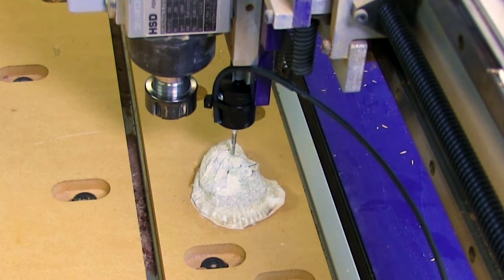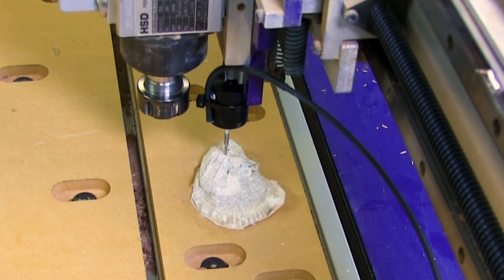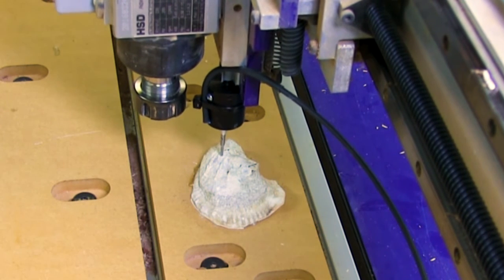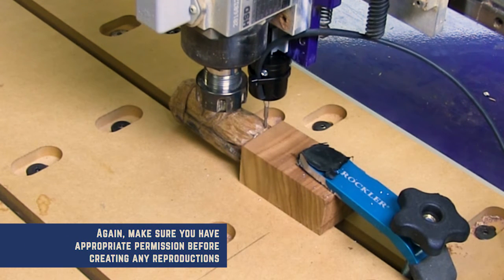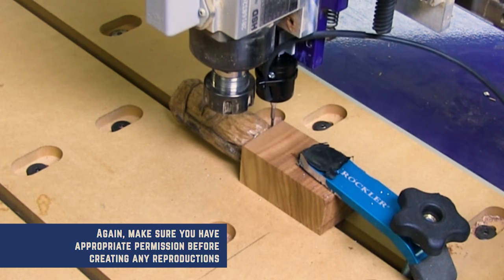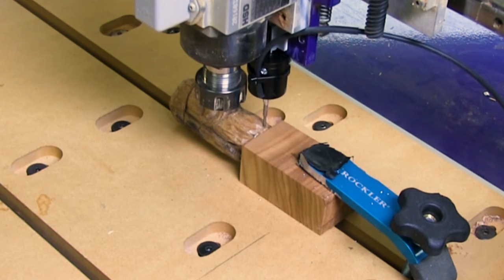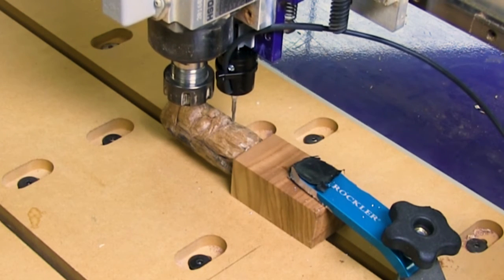The Z is automatically adjusting to that thickness as the probe works its way across, left to right. I'm not doing anything — I'm just standing back and watching all this happen automatically. Once the work with the probe is complete, I'll be able to bring that file into my design software and set this up as a carving that I can do using my CNC, duplicating the shape of the shell. I really love this application of the probe. What it's working on here is a carving in butternut that was done by a really good friend of my family's. There's a finite number of these carvings around, so this is allowing me to duplicate the work that he did by hand and make copies using the CNC for other people in my family.